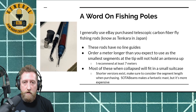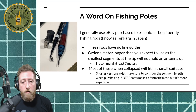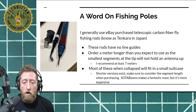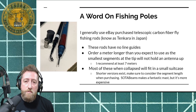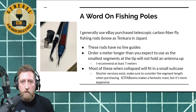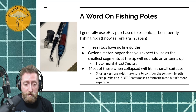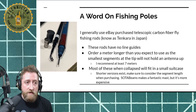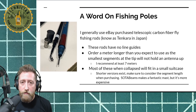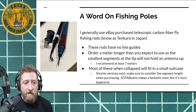There are a number of companies now producing really nice telescopic antenna rods — GigaParts has some, SotaBeams has some. The difference is they'll cost a lot more — $50 or more for a really nice one. The walls are going to be thicker, they'll pack down to a shorter overall size, facilitated by having more sections. The eBay ones are generally fine, but I have broken them. They will fit in a carry-on suitcase, which is generally what I take with me — I'll bring my SotaBeams dipole and maybe one of those verticals with loading coils, and I'm generally good to go with my Elecraft KX2.